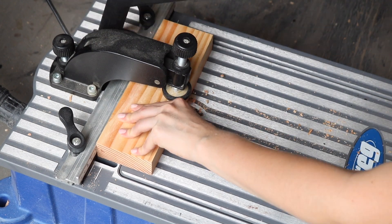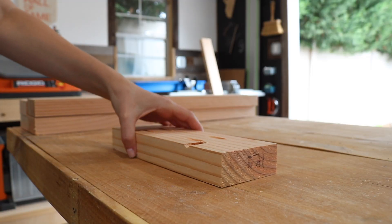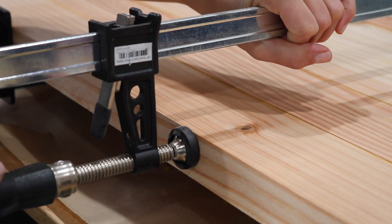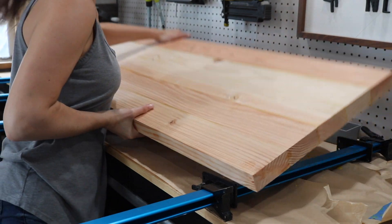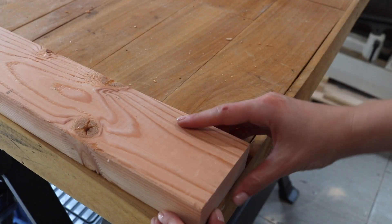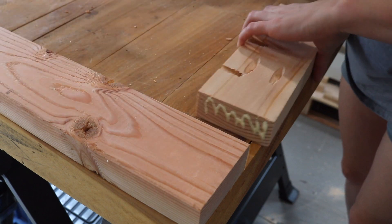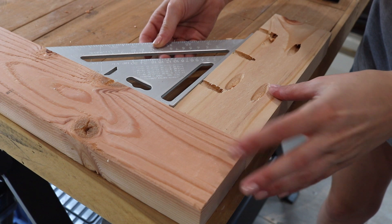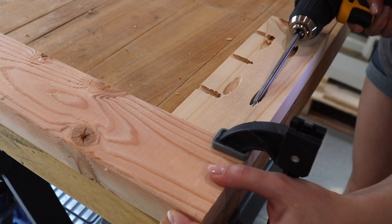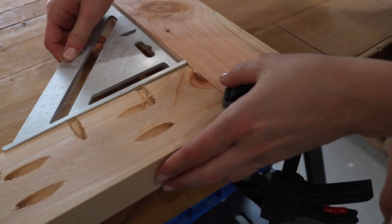If this is confusing, I do have a pocket hole placement diagram on the plans for this build. After getting all pieces cut to size and drilled with pocket holes, I called it a day and placed everything in neat piles with labels. The next day, I started by removing the panels from their glue-ups — they looked awesome. I gave all the pieces a nice sanding, then began assembly by attaching the short side pieces to the legs to create two sides, using wood glue, pocket hole screws, and a clamp. I also used a speed square because the last thing I want is for the tool stand to be crooked. I continued this process with the other side pieces and legs to create the two rectangular side panels of the lathe stand.